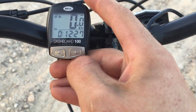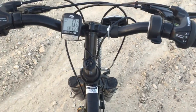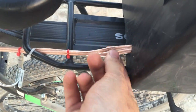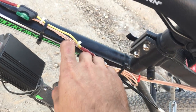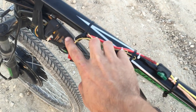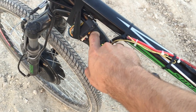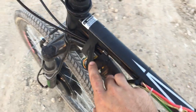I currently have 191 miles on this setup — the battery pack, the motor, the controller. The wiring is pretty simple. I have two wires, one for positive and one for negative, so it's basically four strands. It runs up through a 30-amp fuse — it's a good idea to have a fuse anytime you're messing with lithium batteries. From there it runs into the controller, and from the controller you have three wires for the three phases in the motor, plus the Hall Effect sensor cable because this is a sensored setup.